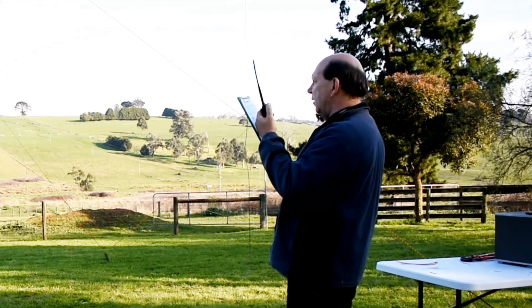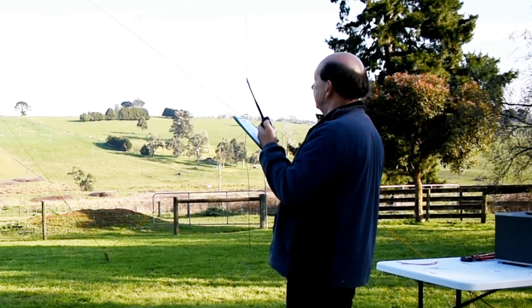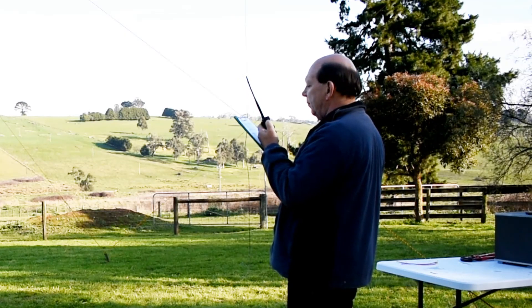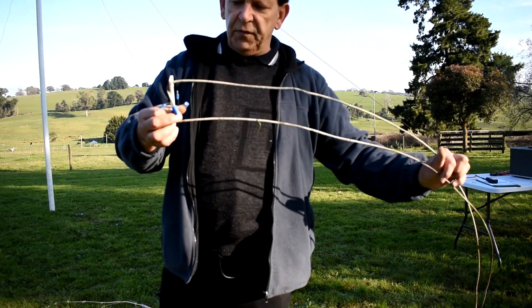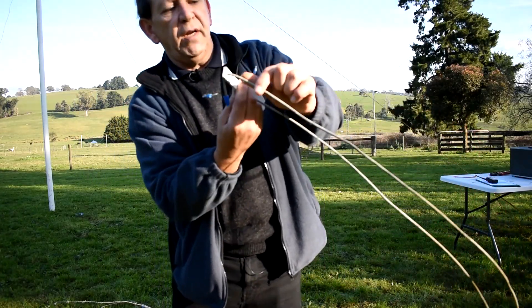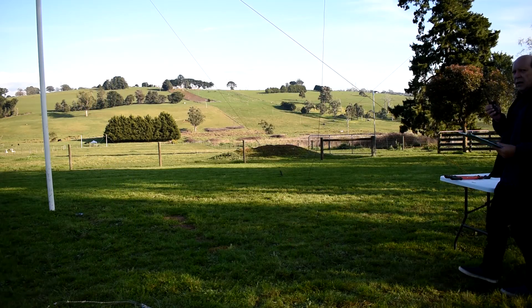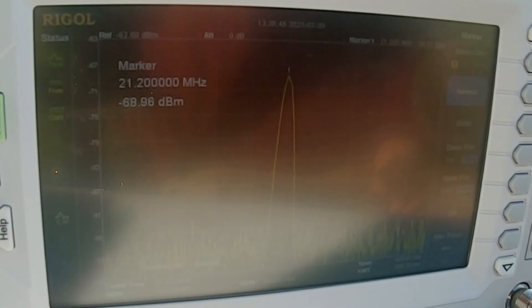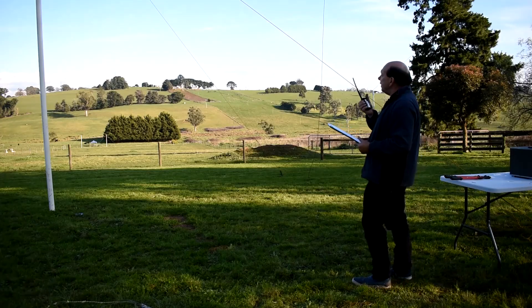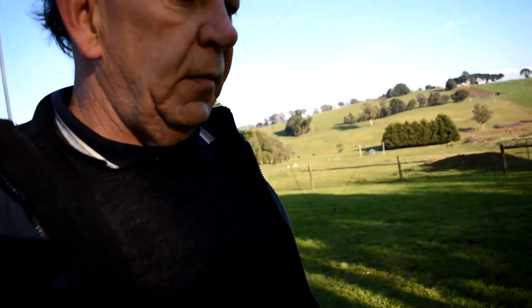The final antenna is the old overland telegraph wire taken from the side of the road near Oodnadatta. It's quite thick at 4.5 millimetres and very hard to work with. The final reading came in at around 69 dB. I think it does well by virtue of its larger diameter — even though it's steel core, the larger diameter probably helps a little with impedance.